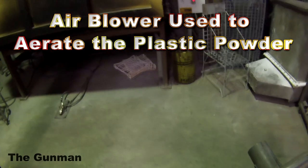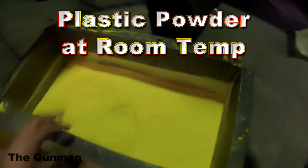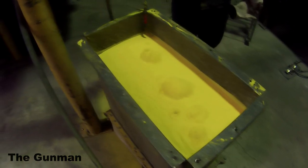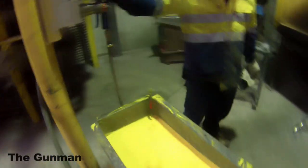He ran through the system with me and showed me exactly what they do. This oven you see here is a curing oven, and the one you saw just a minute ago is a pre-baking oven. Before you put anything into this bath here — which you can see they're using yellow this time — that is basically finely granulated plastic powder. They need to aerate it so you can actually dip the part inside it, otherwise it would just sit on the top. It's at room temperature and it looks like lumps of dust. Once it goes in, it will flow out once it gets baked in that secondary oven.